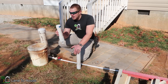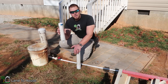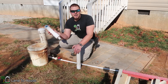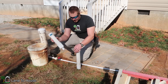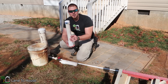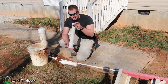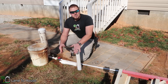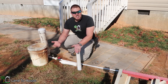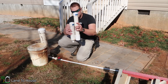So what I think is happening — this one has such a small volume it's able to hit that pressure quick. Whereas the big one would eventually hit that 40 psi, it's just going to take a long time. So I like to ship the mid-size right here in my boxes. It matches the size of the pump and it will start quick enough. It also reaches that psi, it just takes a little longer — and as you can see, that's not that big of a difference.